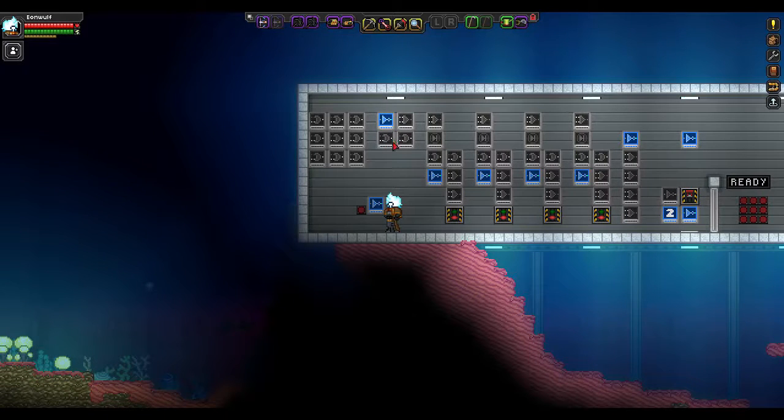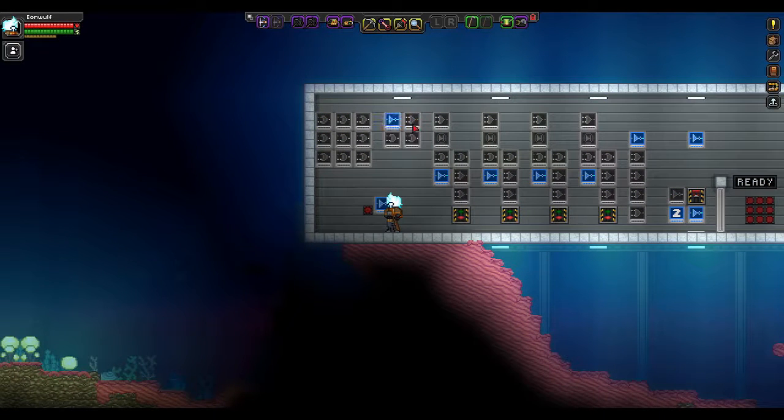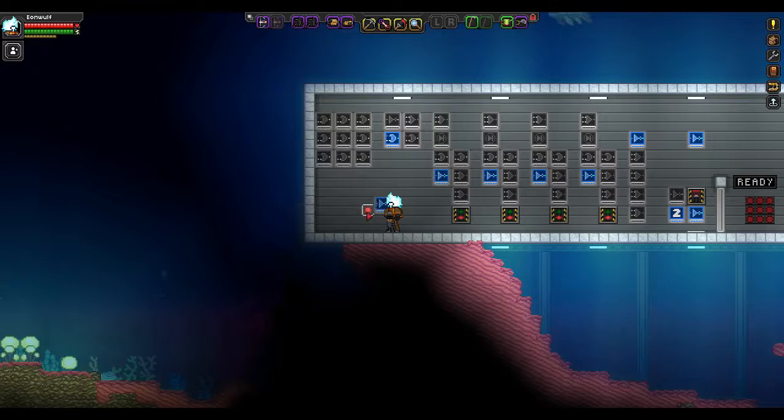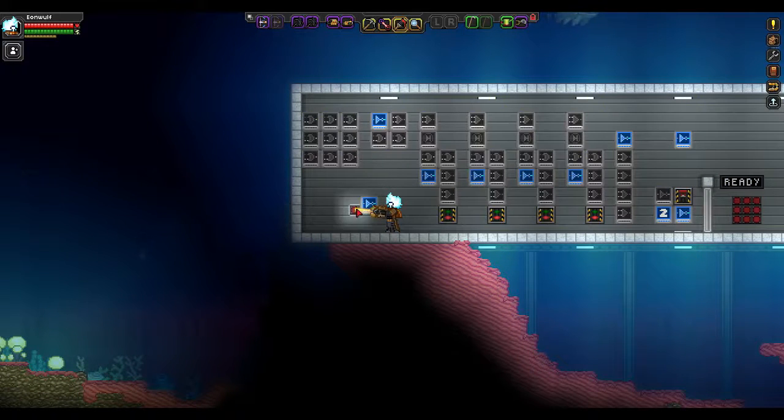For this little section right here, it acts as a quick press. The way we hook it up is we hook up this OR gate to this NOT gate, this NOT gate to this AND gate, and this OR gate also to the AND gate. This second OR gate is just like a little tiny delay that we'll use in part of the thing, so we hook up the AND gate to that. Now if I hook up this button to this OR gate, you'll see that whenever I press it, it just quickly blinks that red AND gate up there — almost instantaneous. It should always trigger.